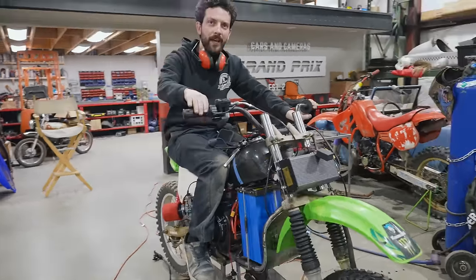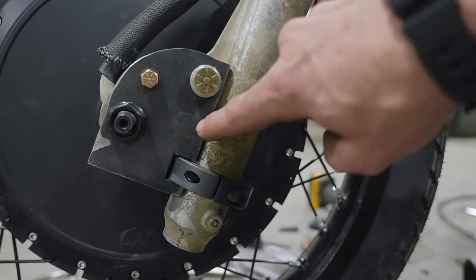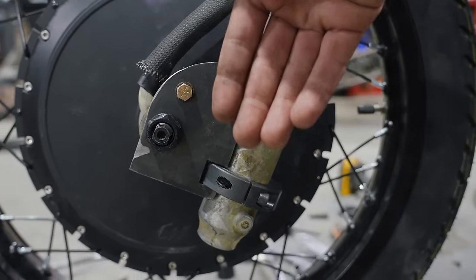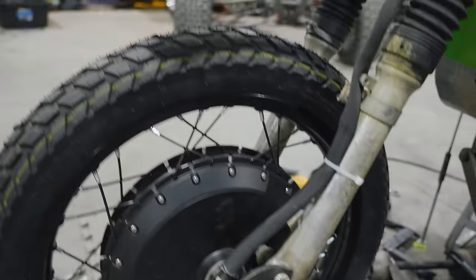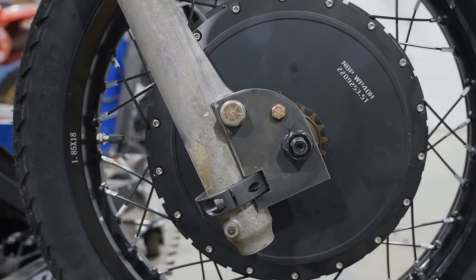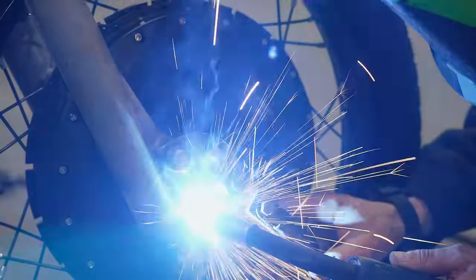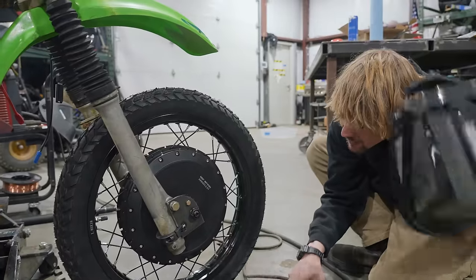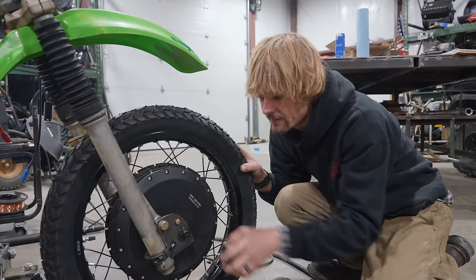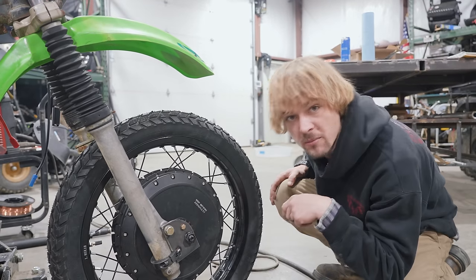We only have it attached in two spots, we need four. The last thing we were missing were these inch-and-three-quarter lock collars so we can notch this bracket and weld on both sides — that way this bracket can't walk. I've got both sides clearanced and notched and I'm going to get ready to tack them. That should be good enough. Now we'll remove them one at a time and weld them up on the welding table and make sure they didn't move too much.